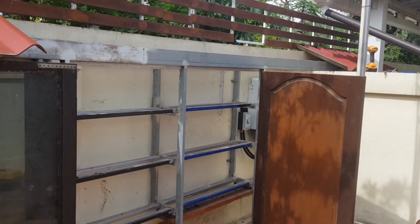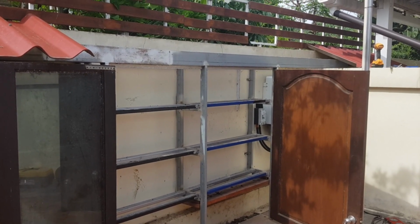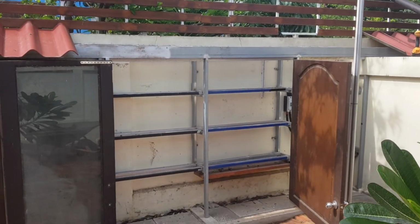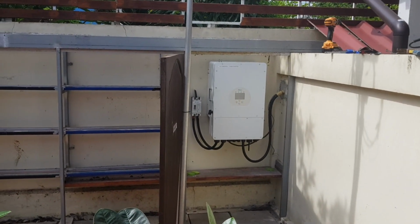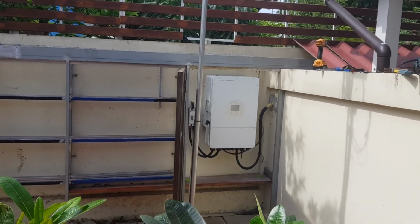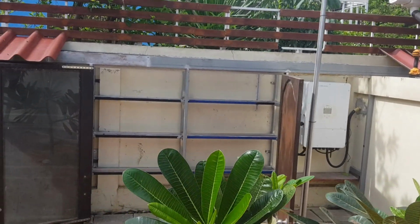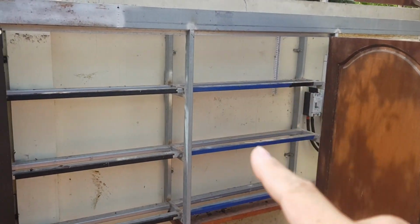I think if you leave this rated equipment in open air and you keep it away from rain and sun, this should actually be better for the equipment than closing it up somehow. And especially, of course, it's hot here, so the heat can just be radiated away from all sides. It would be similar to the inverter. There they say they have to keep it open to the front. It's just that at the moment the roof was too short, so now during the summer season, the sun might touch it a little bit. Yeah, so I think I will do it like that. Just remove the doors. I have to do some structural work now, remove these metal pieces.